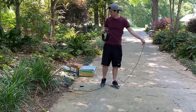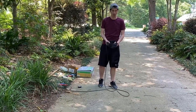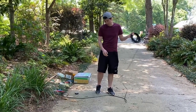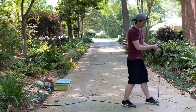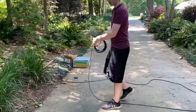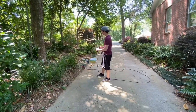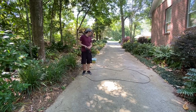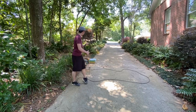One last thing before we do this pull - originally we just had this coil on the ground, and what happens is it usually gets bound up on itself and the wire gets real twisted. A good way to prevent that is to grab the whole coil of wire and walk it out while rolling it out, so that when you go to pull the wire from the inside it's a straight shot and not trying to come off the coil at an angle where it would get caught. We'll roll out about as much as we think we need to get inside and then get started on the pull.